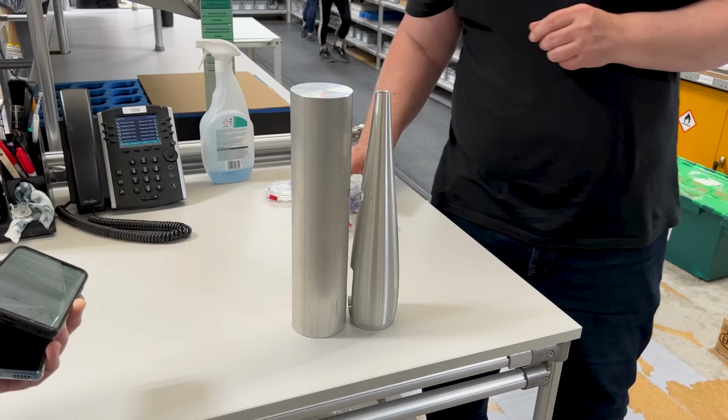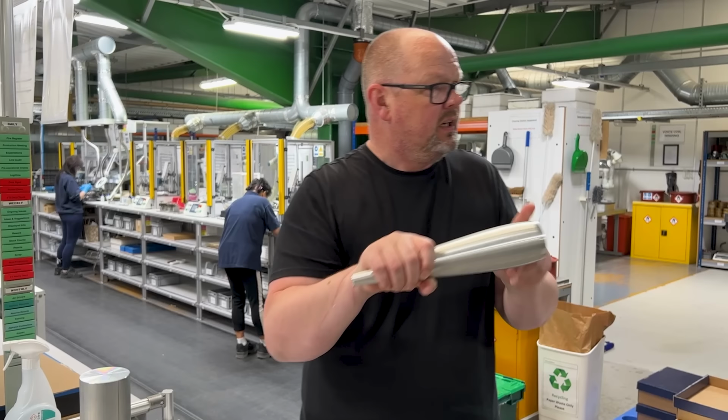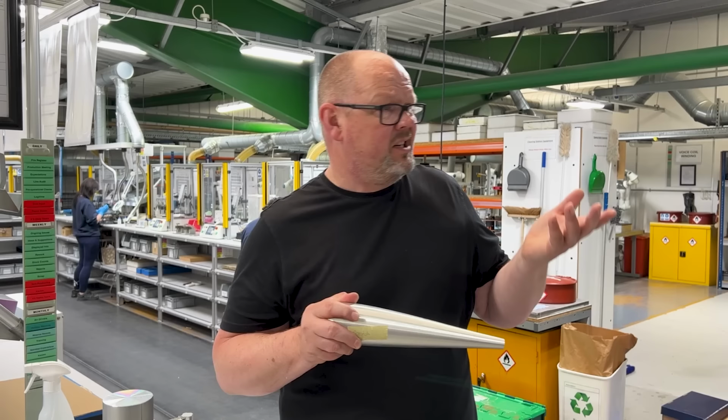So the solid body assembly has been around for a period. Some of you will remember looking at it in the D3 era. One of the big stories in the D4 was that it's longer. If you remember, in the older generation it was more around that kind of length. Now, longer tube lengths in general tend to be more desirable. You all understand the reason why we use those tube lengths, right? Because what we're doing is trying to take the back of a cabinet away from the back of the diaphragm. Essentially, it's the same premise as we used with the Nautilus more than 20 years ago.